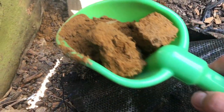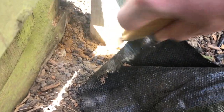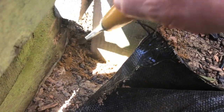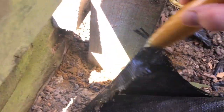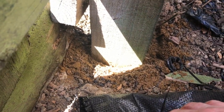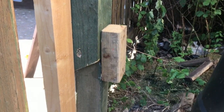But that's not a problem. What I'm doing is I've got some dry sand here and I'm just going to drop the dry sand in and then wiggle it about. What will happen is it will go into the crack and fill the crack and set like sandstone. I'll do that and then put some concrete at the top just so the last bit sets completely. That will basically fill the gap, and once sand goes hard it's pretty unmovable. As you can see there's no movement left in the post. I'm really pleased with that — very good.